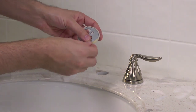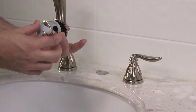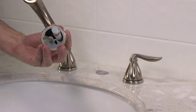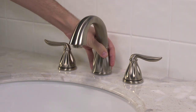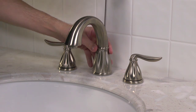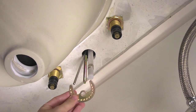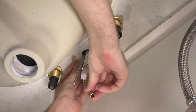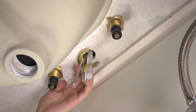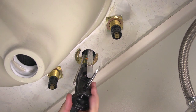To mount the faucet spout to the sink, apply plumber's putty in the groove along the bottom outer edge of the putty plate. Next, feed the water supply lines through the hole in the putty plate and into the hole in your sink. Then insert the lift rod into the back of the faucet, make sure it moves freely, and return to under the sink. From underneath, secure the faucet to the threaded mounting post. First comes the metal horseshoe washer, which is designed to accommodate the lines feeding out of the faucet — be sure to have the bumpy side facing up for a tighter seal. Next is the long mounting nut, which you'll tighten onto the sink using the quick install tool.